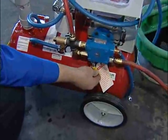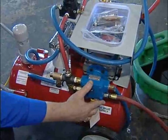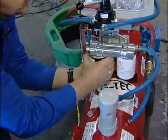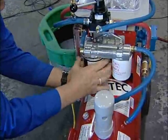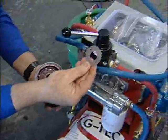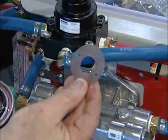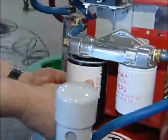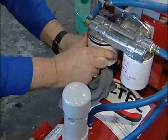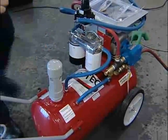Crack the air again to blow all of the fluid back out of that filter, then turn off your air and remove your filter. Examine your screen — if you see any dirt or debris on the screen, it's telling you that you need to continue to flush. Our screen is clean, so we have this job finished. Put your filter back on and make sure it's tight. Take your screen and put it back on your tray. Next, unhook your lines.